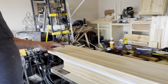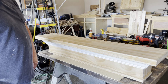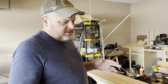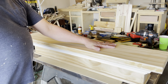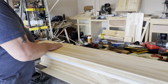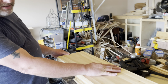All right, different people are going to be looking for different things out of our lumber. I wanted a clean look. If you go to any of your hardware stores, you can get what's called a select pine, oak, or poplar if you want to stain it. This one they actually requested to be white. I went with select pine so they wouldn't see any knots. It's not really a country decor, so they want something smooth and crisp. If you look at the select pine, you'll notice there's not any big knots or defects, just good straight grain. And you won't have to sand it as much. You'll still need to sand it.